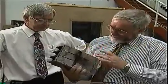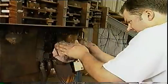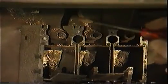This second breaker was extensively damaged. Arc products exhausted out of the device, causing additional arcing on the line-side bus bars. Respected electrical engineer Peter Crosley comments: After the first test, certainly the integrity had gone. The contact resistance clearly went up each time. My main biggest concern out of this test is that there's no clear visible sign that the breaker was damaged. The integrity of the breaker certainly has deteriorated. The second breaker was clearly unserviceable. We couldn't use it again — it virtually vaporised internally. Parts of the breaker went right across the test station, and that certainly probably would have killed the operator.